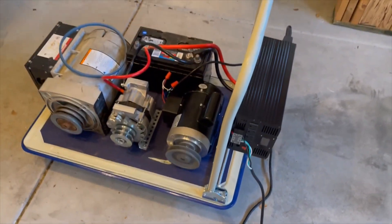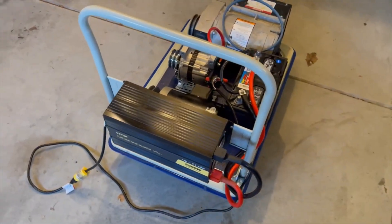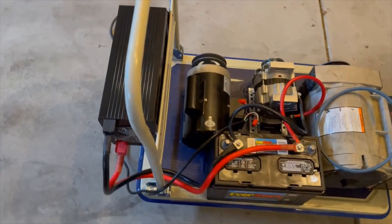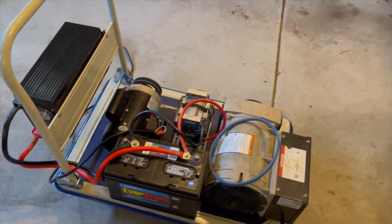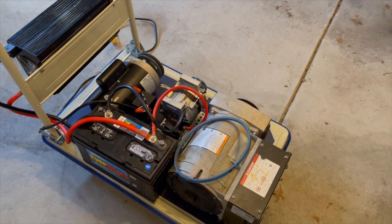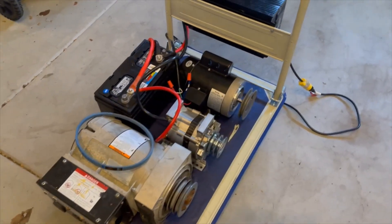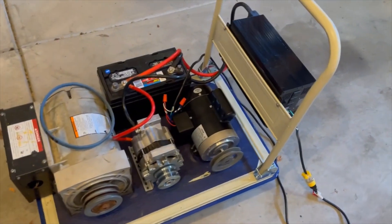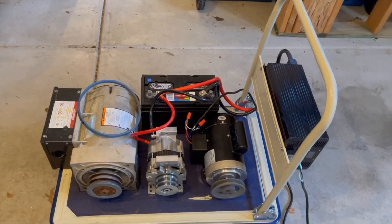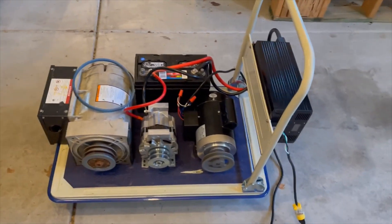So that does work, but the next thing I'm going to have to do to get this working — it's back to the drawing board. You can see that's the cord to the new motor, there's my two battery cables, the inverter battery is hooked up to the alternator. The idea was to recharge the battery as the inverter used the battery charge, which would work in theory. But I didn't realize how much the 10kW generator and the alternator, once they start generating electricity, really require a lot of torque to turn. At least the inverter and the motor are working, so I know that's good.